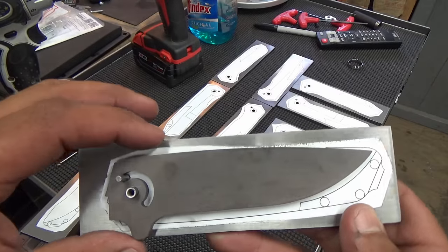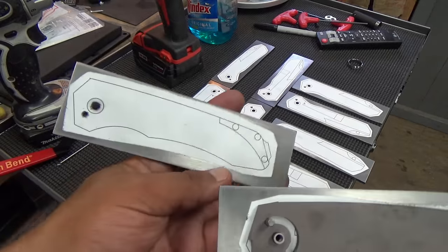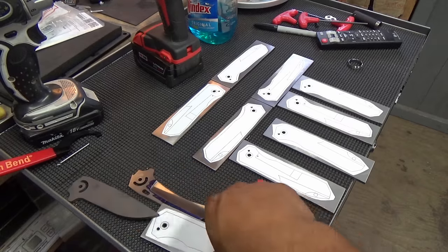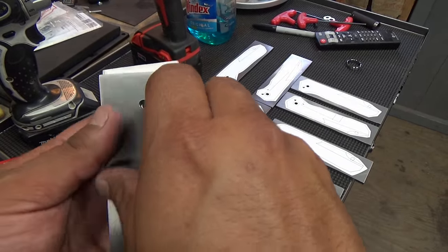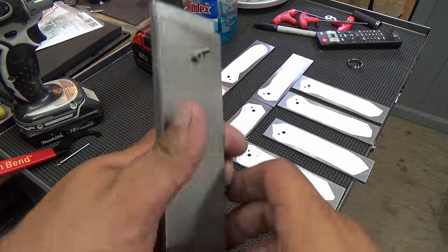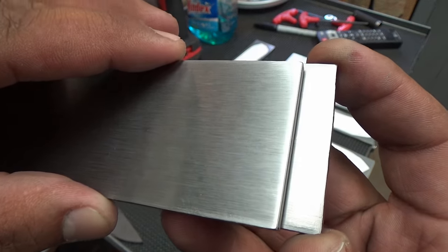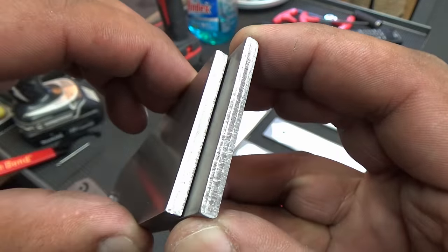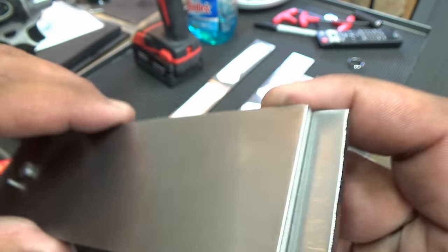But this doesn't mean everything. We still have to profile these handles, and then they have to be perfectly in relation to this one. Now there's an inherent problem with that. You would think that if you just take the two handles and stick them together with those two pins, then you'd be able to cut them out. But I'll show you on this side — you still get a tiny bit of wiggle. It's just because those two holes are so close together that that little bit of wiggle can throw you off.